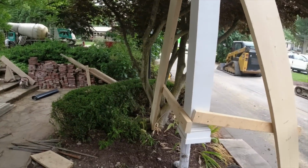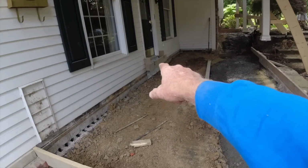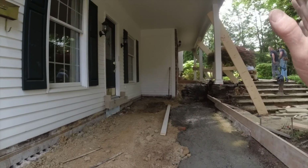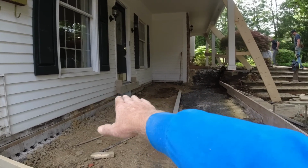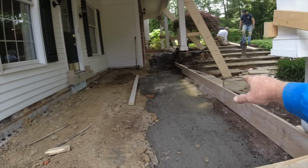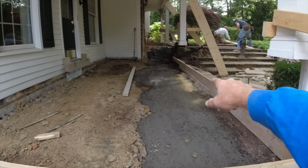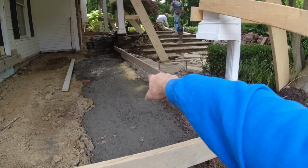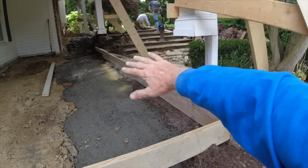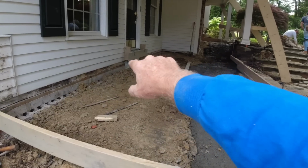and here we go. Okay, bring you up to speed a little bit. We have our sill attached right there. A light 2% coming out. We're all under roof, we don't need a lot of fall. We just need any rain or snow that blows in there to make its way to the edge. So we have about 1% coming across. That gave us a 5.5 inch step. Right below that they have a 4 inch step. So that's our fix. We know we need to be there to work the siding. It is what it is.